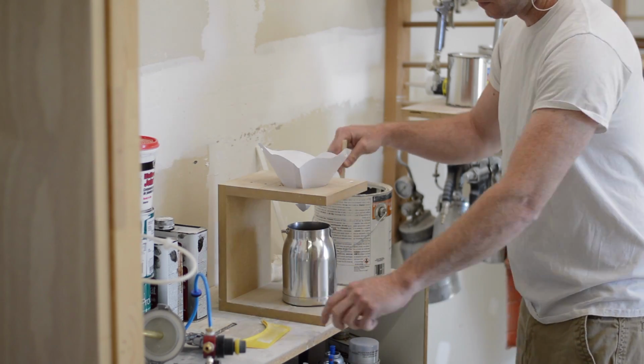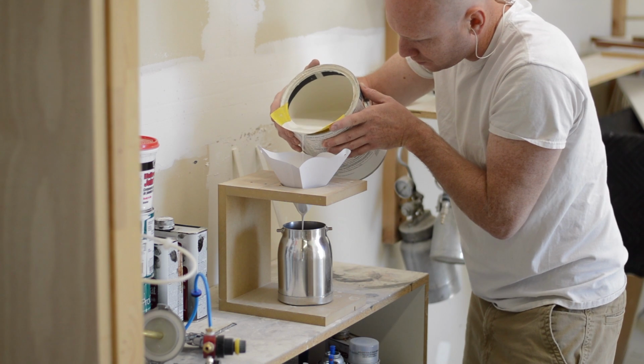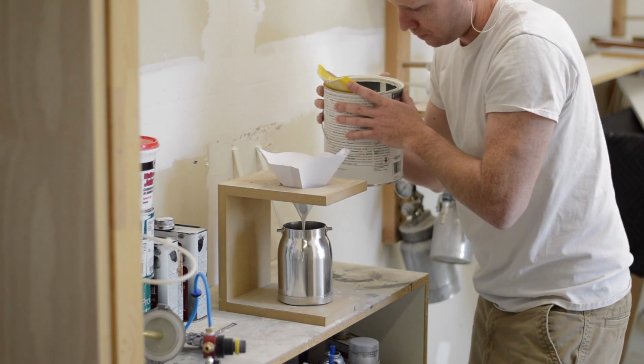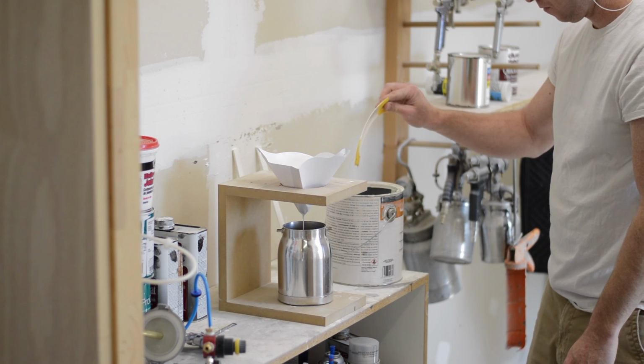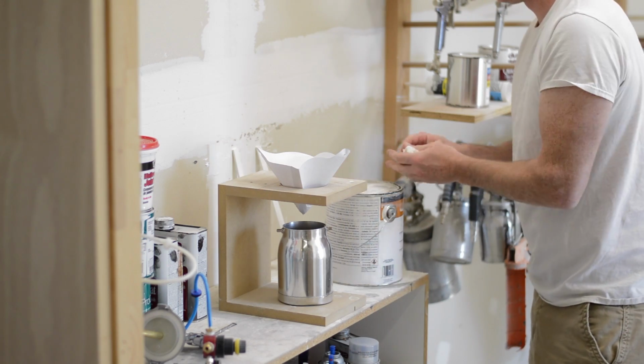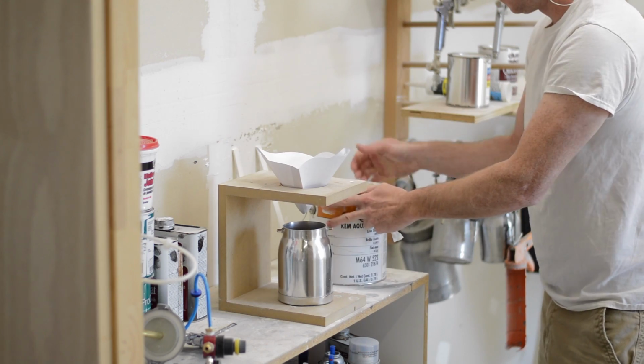Alright, now it's time for 2 quick pro tips. 1, stir your water-based material about twice as much as you think you need to. And second, you want to run your material through a filter. And of course, here I'm just showing off my awesome shop-built filter stand. And this is my process for giving my right hand bone spurs and carpal tunnel.